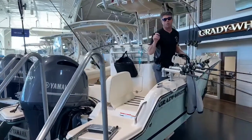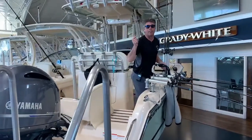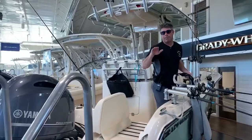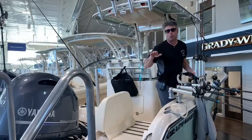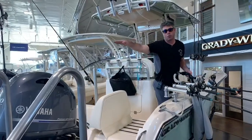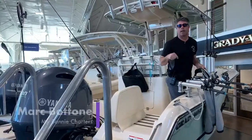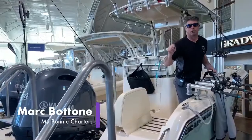If you're running a boat with twins, like my boat's got twins, I put one on the side that the motor's running. That prevents the boat from doing that little arch. So if I have my starboard motor in gear, that boat's going to want to push to the port. I throw a bag in the water, it alleviates that. It helps my autopilot remain in a straight line, and it brings me to trolling speed.